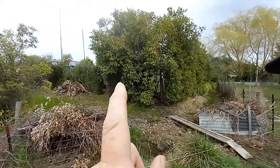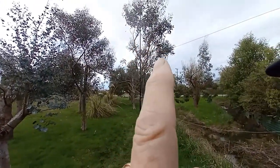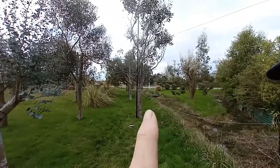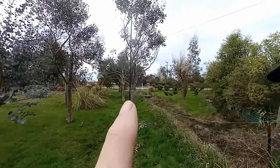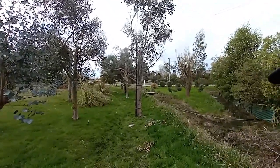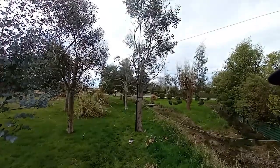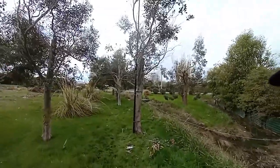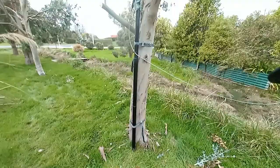Today we've just erected a 20 meter elevated vertical antenna — you can hardly see it. I won't go into all the details and measurements because most people know about verticals these days and there are lots of videos on YouTube about them. Basically we've got a five meter element on a seven meter pole, just lashed through the tree.